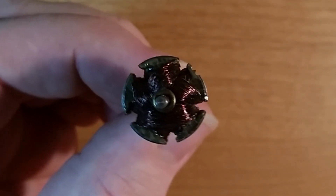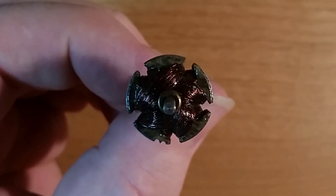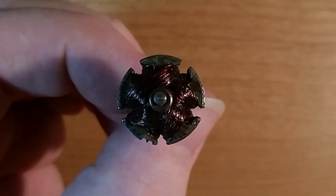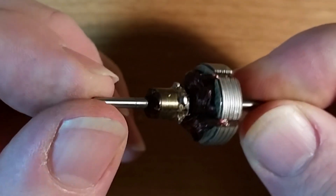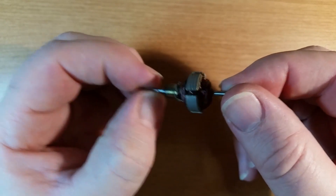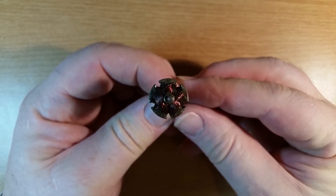I suspect that large motor hasn't been apart, but I'd guess it has far more than three slots on the armature and possibly four, six, or even eight poles. This here is a five-slot armature — built very much like the three-slot I showed you before, but with five teeth on the armature and five contacts on the commutator. The reason for more teeth is that you get smoother torque delivery with more teeth on your rotor.